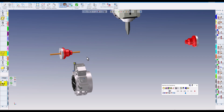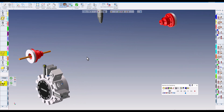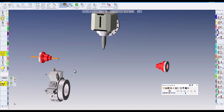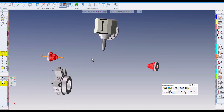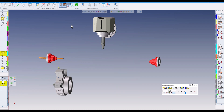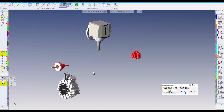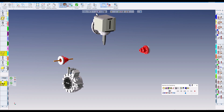That's how to sync multiple flows. Anytime you have multiple turrets you'll have multiple flows — whether it's an MTM-type machine, a Swiss machine, or anything with multiple turrets. If you have three turrets you'll have three flows and can sync between all three using the sync control. Just program it normally as you would, then run the sync control and you'll have a good-looking part. Thank you for watching.